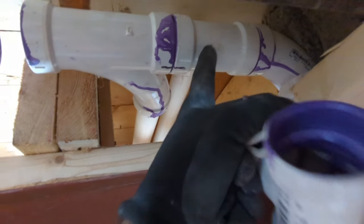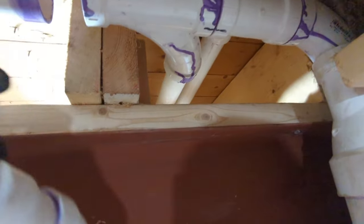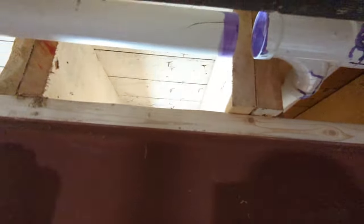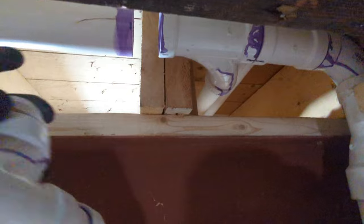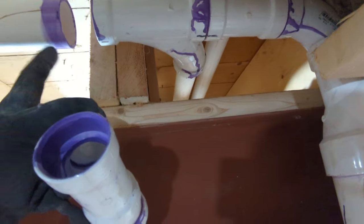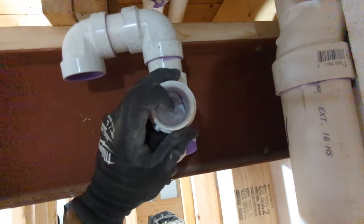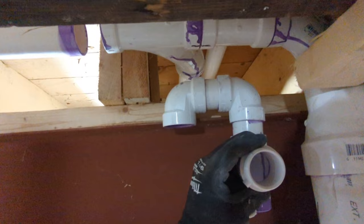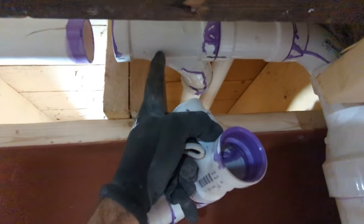So if I wanted to vent that, which I ended up having to do, I want to be previous to the flow. So if the atmospheric pressure is going up and following the flow back down, it's not flowing by where it's drawing the atmospheric pressure from. And so unfortunately, I had built this upstairs to where the drain goes on the right and the fluids come down the right-hand side and the venting follows on the left. But as you can see here, if I'd done that, my runs would have been lined up pulling atmosphere downstream of where the fluids go by.